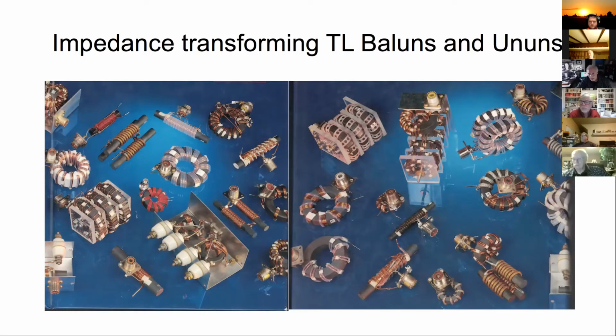But that you can adjust by simply spacing out these wires a distance. And that's why he encased them in the Teflon tubing, because that keeps the distance pretty constant between the two wires. And therefore, you obtain some sort of characteristic impedance of these things. So they're very easy to make into whatever characteristic impedance you want. And we'll talk about in a minute, characteristic impedance is important.